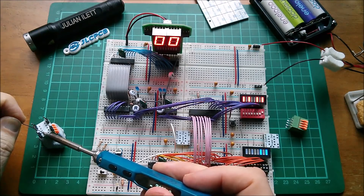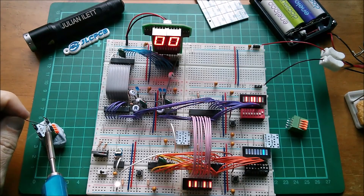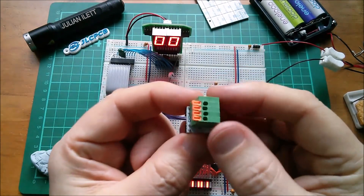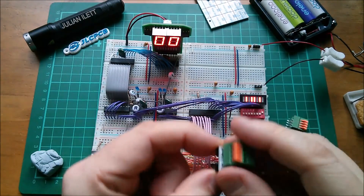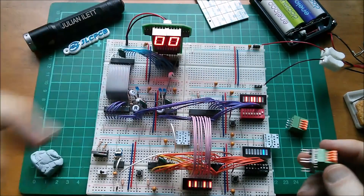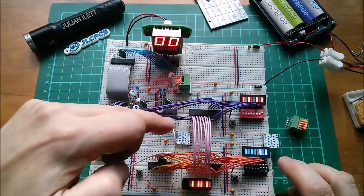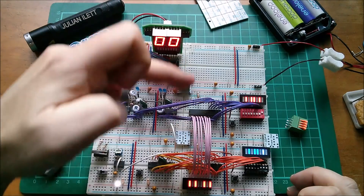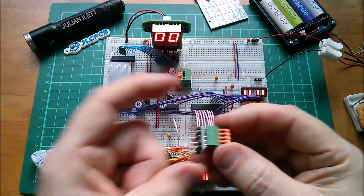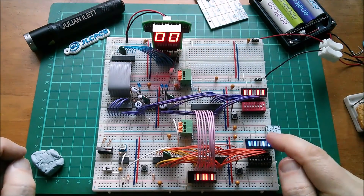There's my iron on. Just put that on some blue tack — I can solder that. It's slightly tricky but doable. Solder all these connections. It's a bit of a shame that it obscures all my silkscreen, but oh well. Plug that back in — still working. Does this brighten up? Yes it does. And if I put the connector in this one as well, I can actually put some bridging power links in there with some red and black wires.